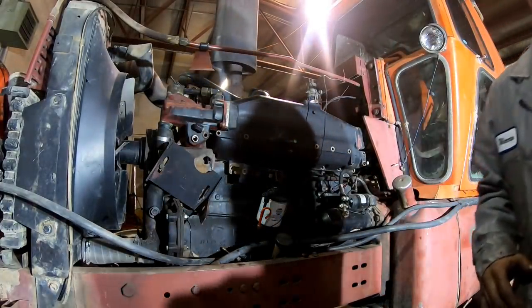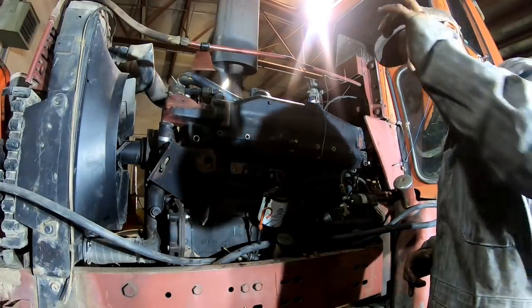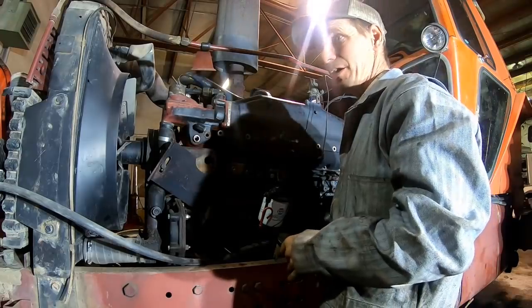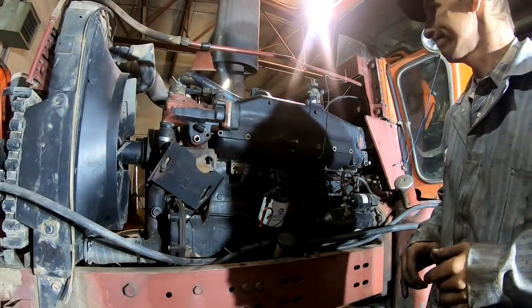And get some of these diesel pickups. I need to get that 6.4 Power Stroke, get the cab off of it, put a high pressure pump in it. Got the high pressure pump in that one, but it needs a full set of injectors too, because that metal went through everything.